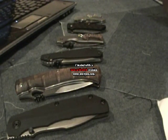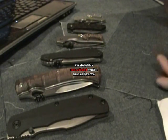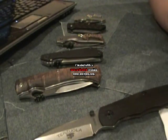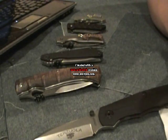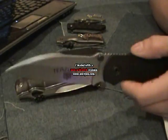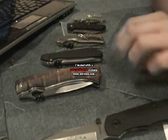Then you hit the low alloy stainless steels such as 440C and the 400 family, the 154CM — which stands for chrome — and 154CM stands for chrome molybdenum. Now when you see knives with CPM before the name, CPM is just a process where Crucible turns the steel into a powder, making it more fine and boosting the stats a little bit. But 154CM compared to CPM 154CM — they're the same in terms of what they contain.